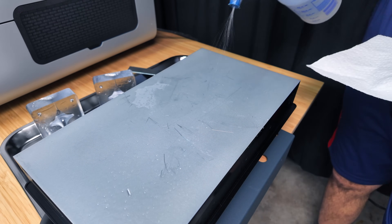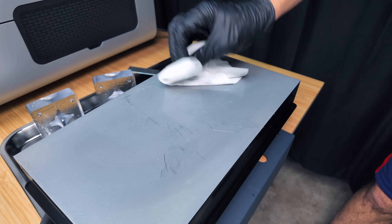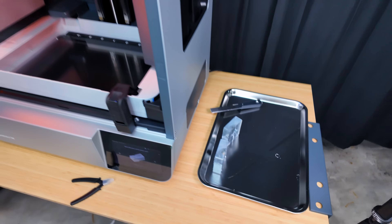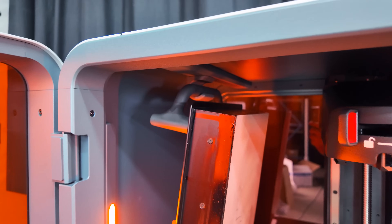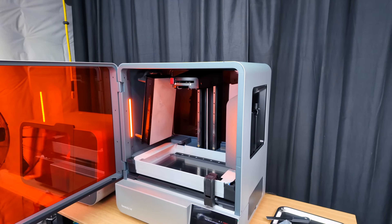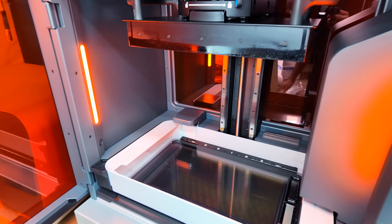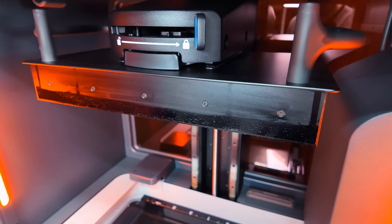Formlabs recommends washing the surface of the print plate between each use, so I'm doing that with isopropyl alcohol and paper towel. I noticed a lot of resin spilled on the plate despite leaving the print bed in the printer overnight so that resin would drip off. Formlabs actually has a hook in there which allows you to put the print bed at an angle to drip and not waste expensive resin — we'll use that next time. Also, I noticed I have hairs and residue left from regular paper towel on the print bed; now I see why Formlabs includes lint-free paper towels with the kit.